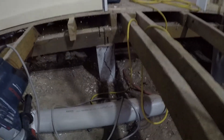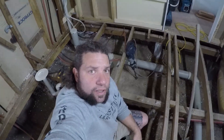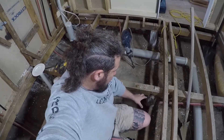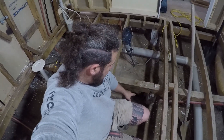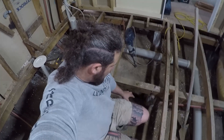Here is a stump and here is another one. If you can see, this one's got a big split in it and here's a hole that I'm digging right next to it. You have to be careful when you're digging a stump hole next to a stump because the actual stump can collapse. I'm doing it this way because we've actually got stumps in both areas and I've got a jack just under the other side of it.